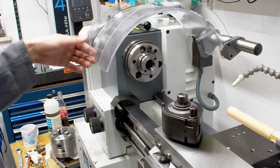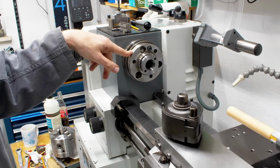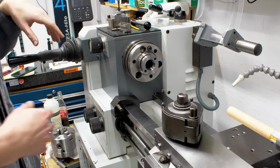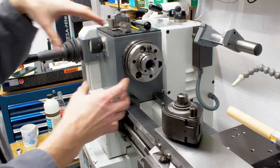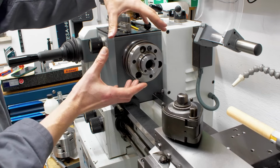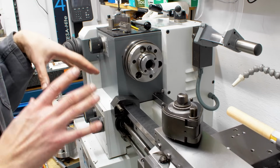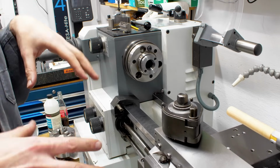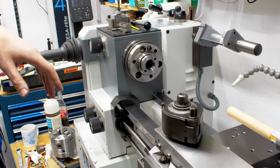That's very nice. This can be useful if you do faceplate work, for example, and you have parts bolted onto a faceplate which are fairly heavy, and the rapid stop of the braked motor could shift parts on the faceplate from the inertia. Or you just don't want to hear the ka-clonk noise all the time.